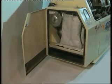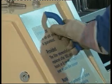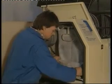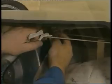Located in the extraction compartment on the left hand side is a multi-pocket filter. This should be manually shaken using the external handle after each cleaning cycle. If the filter is replaced, ensure it is securely fitted at the base and the top ties fitted to the top of the bag are tied, but still allowing movement for the bag beater.